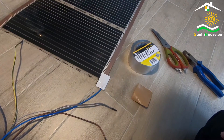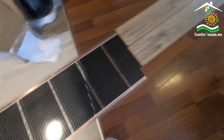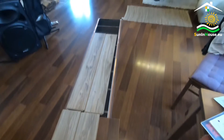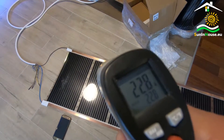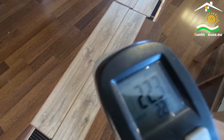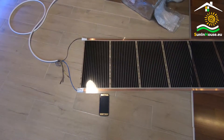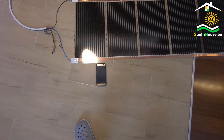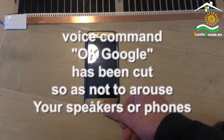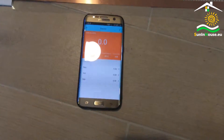Let's see how it heats up. We have everything connected and ready for testing. The foil lies on different surfaces: on terracotta floor it is not insulated from the bottom, then on floor panels, similarly on floor panels lying additionally on the underlay foil, and the last section lies freely. Before turning it on, let's check the starting temperatures — at this point 22.6 degrees, same on the floor panels, overall 22.5 degrees. So we turn on the power to the foil. Google Home has turned on the heating.